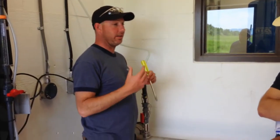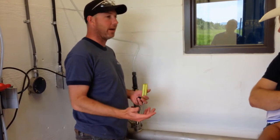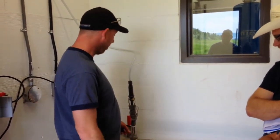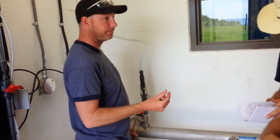You might get a little bit of hardness at the tip because as soon as bleach hits water, hardness comes out a little. So, like, if you think, I don't know, you guys have hardness here? Yeah. So, like, you imagine cleaning your shower heads or whatever, well, this is probably going to happen, like, 1,000 times faster. Because you're oxidizing that water, so it's immediately coming out. So, at very minimum, I would probably pull this once a year and just check that tip. And just make sure that it's not clogged up.